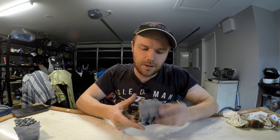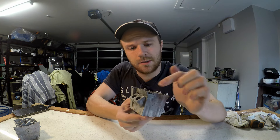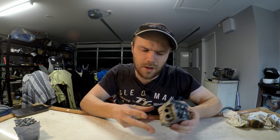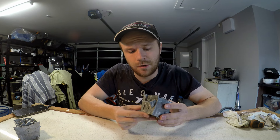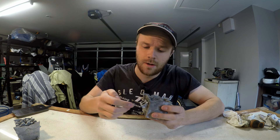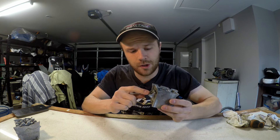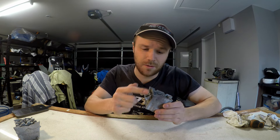There we have it — I've finished cleaning up the top and the bottom and they're not too bad. There's still some imperfections, but the main thing I need to work on is the intake side where there's still some shrinkage. On the exhaust side it's pretty much perfect, even the surface finish is very good, but on the intake side it's no good. I came to the conclusion that the mass of the intake itself is far bigger than the exhaust, so there's more shrinkage occurring and it's stealing material from the thin sections around the intake. For the next one I need actual feeders on the intake itself to stop it stealing from the thin areas.